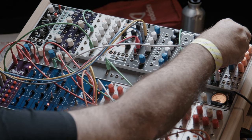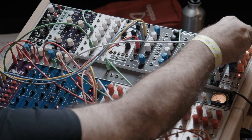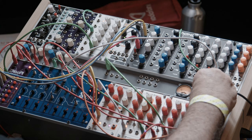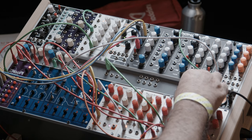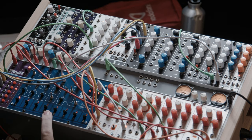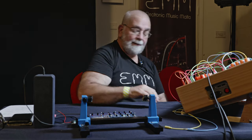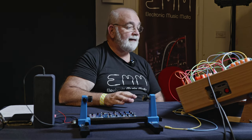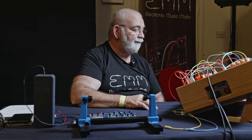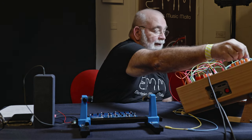As you can see, the progression rate is being set by the LFO. Okay, so what is the big deal with controlling it from outside? Well, that is part of the creativity capability of the unit, because while the internal oscillator is only adjustable manually, the external one can be anything. It can vary in frequency by itself. You can have another LFO controlling the clock LFO, so you can have varying frequencies or effects or soundscapes available to you.